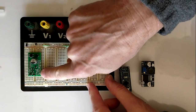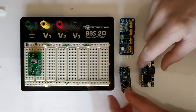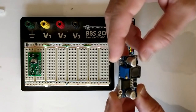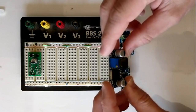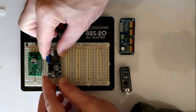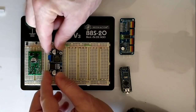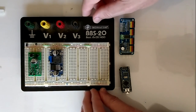There is also an input that we are not going to use for this decoder, but that can be used to send an acknowledge pulse to the programming track. The second module is the buck converter, which takes an input voltage of up to 40 volts and converts it into an adjustable voltage between 1.5 and 30 volts on the output side. Buck converters are much more efficient than linear voltage regulators, which is important when driving servos.